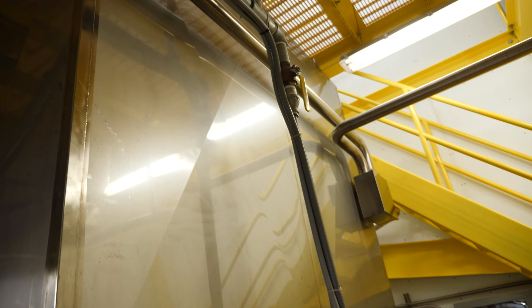The powder falls down to the bottom without any moisture in it, then it goes up three stories and falls down into the hopper up top. This is the sifter here — the protein is coming down. You hear those loud knocks; they're just knocking the powder off the walls in here. Inside there are cloth bags that catch the particles out of the air, and then they're filtered through a screen into the bagging room below.